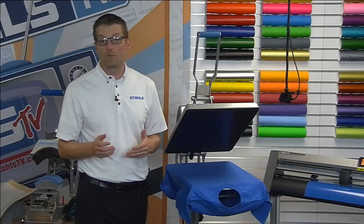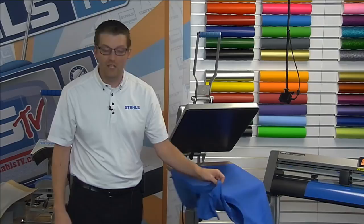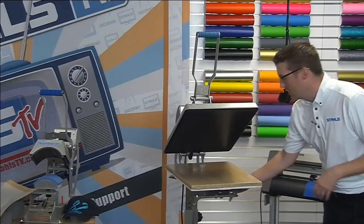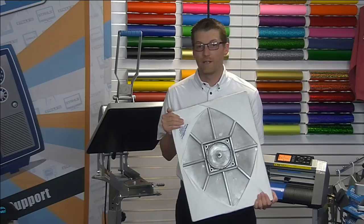You may know you can drape the collar off on your existing press, and that works. But when you get into youth garments, team uniforms, bags, or jackets, you're going to have real challenges without a threadable machine with interchangeable bases. A youth t-shirt on a full-size platen will just stretch and not work, so it's important to have both threadability and interchangeable platens.